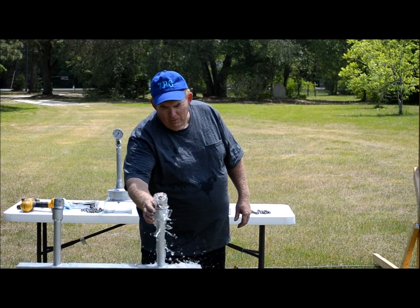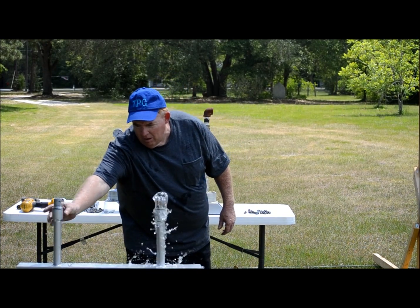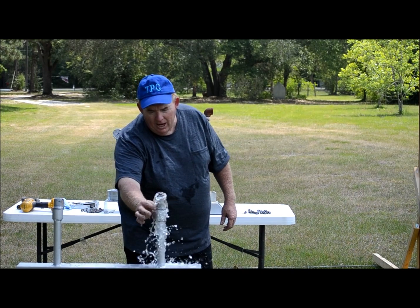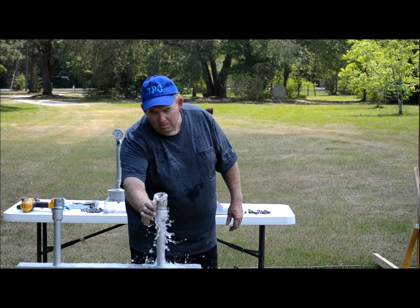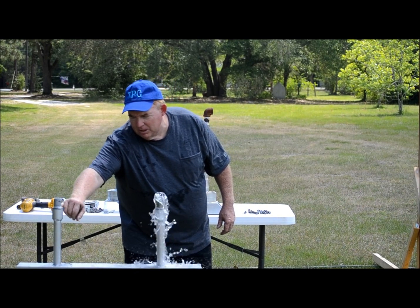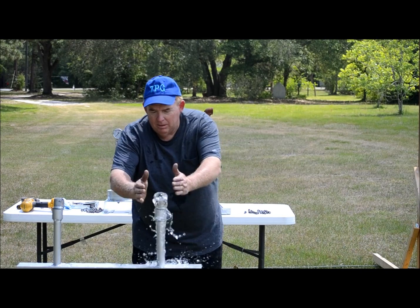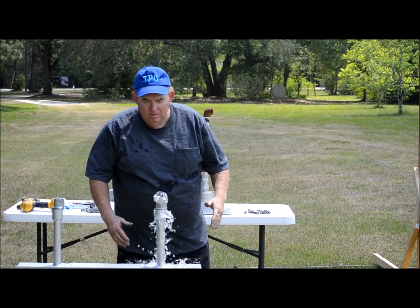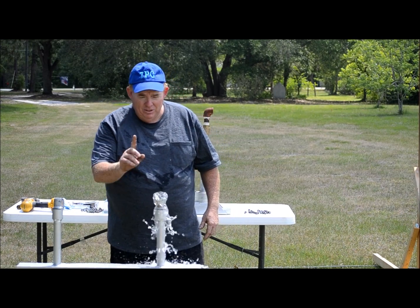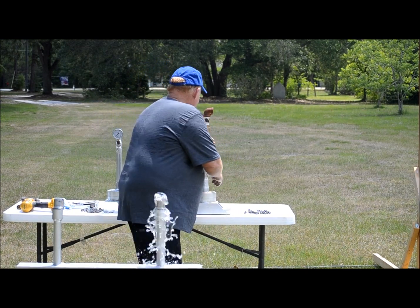And this is not a paraflange, this is actually a collar, more of a collar than it is anything. The reason I made it so small is to illustrate how little it actually takes to lock on a seal. The bigger the flange, the bigger area I've got to lock onto. But basically all I'm using is this outside edge, no matter how big. The outside edge is all I'm using to seal this thing. So what I'm fixing to do is lock on.